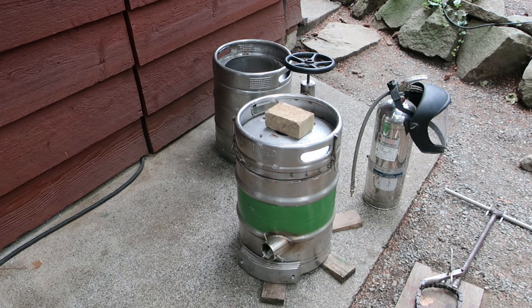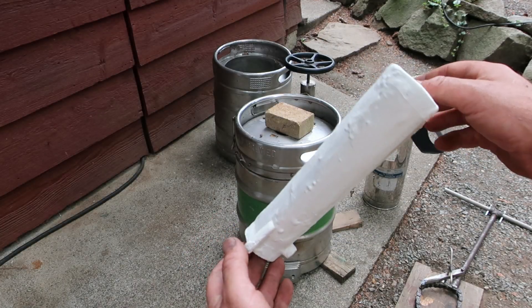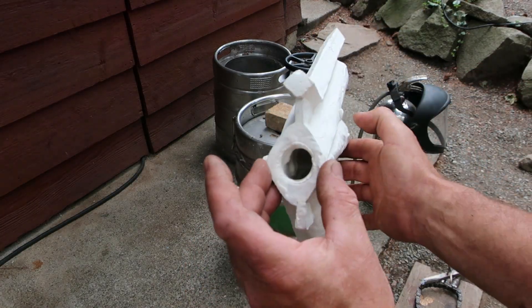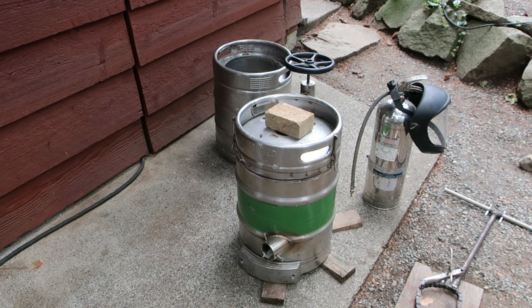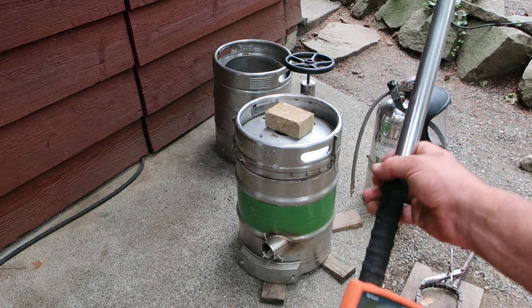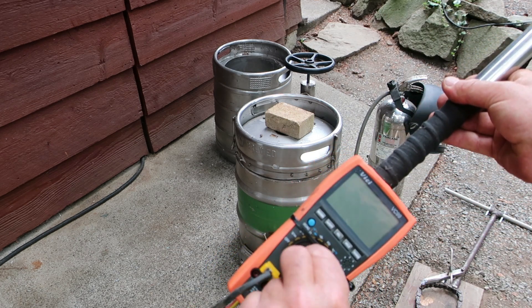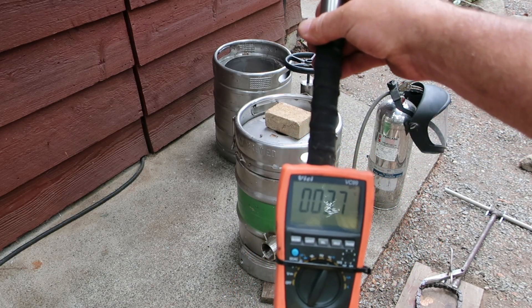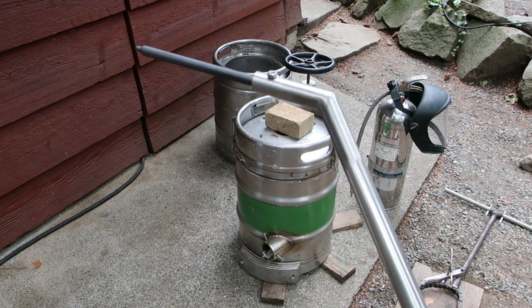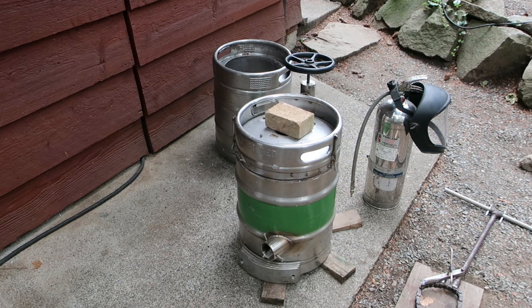The sun is fading and rain looks like it's on its way. Here are the mudded molds — they've been drying for about a week — the lost foam pieces. This is a pyrometer I built years ago with parts, hooked up to a multimeter. It just gives you the temperature, so I should be able to figure out the aluminum temperature fairly accurately — it's all homemade stuff. As it looks like it's going to rain, I'm going to put it all on hold, let everything dry down, and we'll take another attack at it.